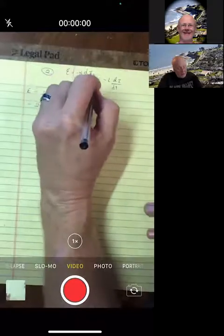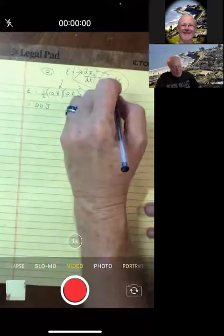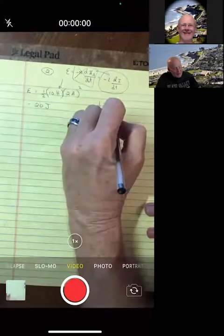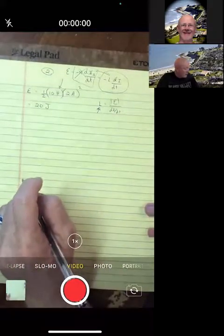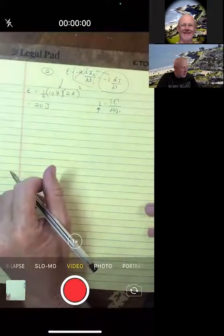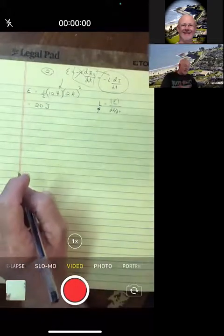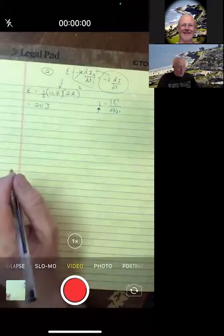So this is our fundamental physics. And then applied to itself in a circuit, this would be a good way of writing it in a circuit. But then what that means is you can then write inductance as the magnitude of the EMF divided by the rate at which the current is changing. So if you give honor to, I think it's Joseph Henry. No? I might be confusing that with something else. But Henry, last name, you give honor named after him, like we do with joule and ampere. We give a unit after this.